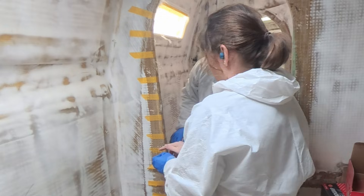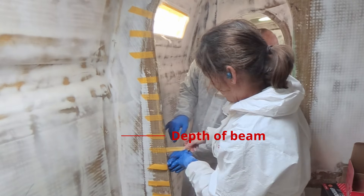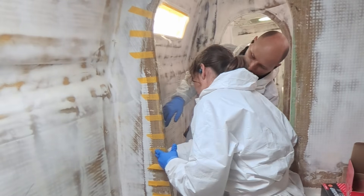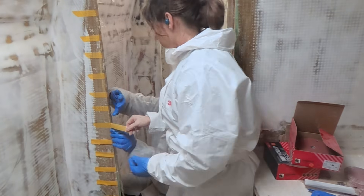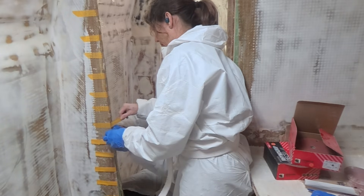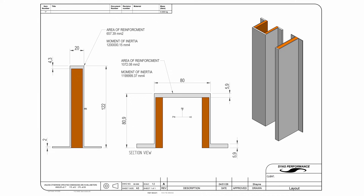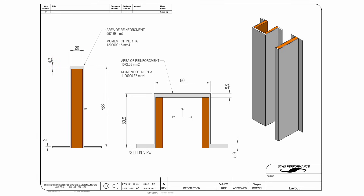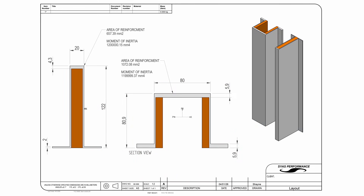Yes, that's one way of thinking about it. The depth of the beam is from the hull to this edge. We've got to put a lot of strong material on this edge here to create the beam. It comes down to basic beam theory: you've got two ways of creating stiffness and strength. You can either make the beam really deep and not require much material at either end, or you can make the beam shallow and put a lot of material at the top and bottom.